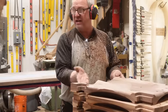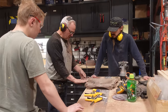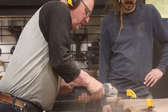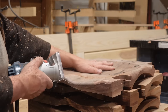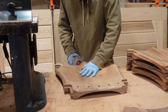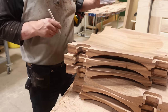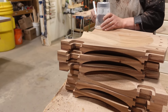We're using a round over bit on a router around the edges of the seat just so we don't have to file off all those edges completely by hand — it just gives us a bit of a reference to go from. Then we're going to use a bulk barn measuring jig to measure the radius on the corners of these seats that we're going to cut off.